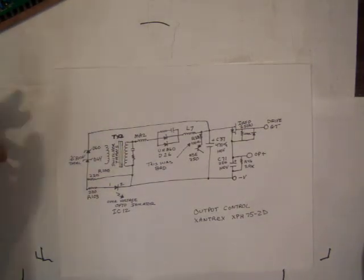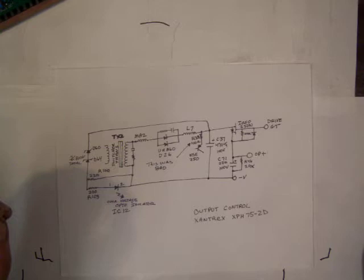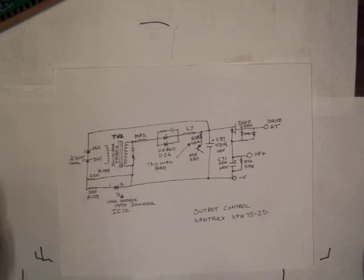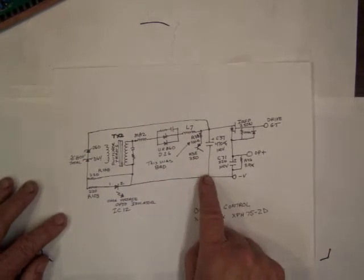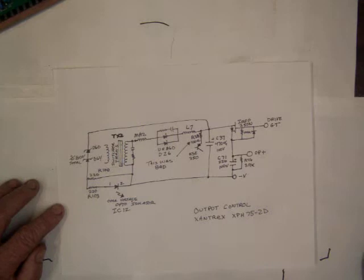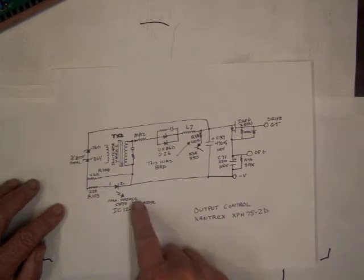If you look at the power supply sections, you have a diode, you got a FET, you got an inductor, and you got a capacitor. Well, that's a simple buck converter, right? Well, no. I've actually never seen one of these before in a supply, but the problem I was having with this is that this thing was going into automatic shutdown.